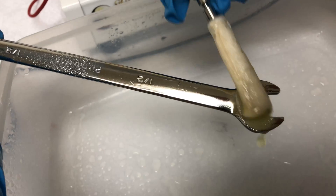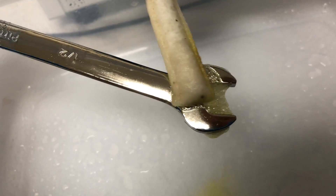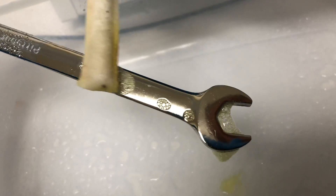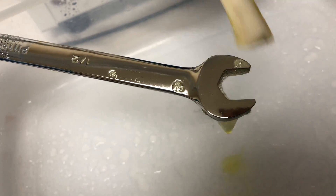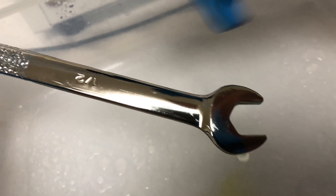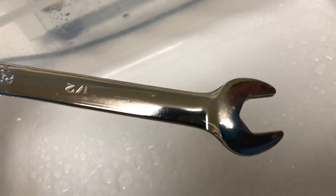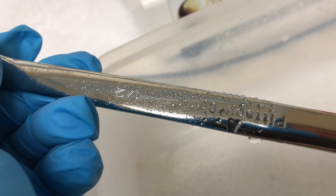We've stripped it, though I thought it needed a little bit more — better safe than sorry. If you suspect there's any chrome at all, get it off, because that's the number one problem people have: they move on too quick, don't get all the chrome off, and then later there will be white hazy or dark hazy spots, or the gold will just wipe right off. Really look at it and watch what the water does.